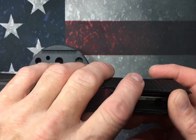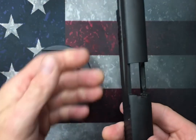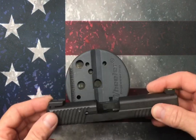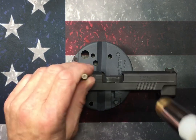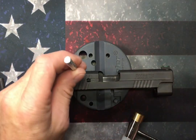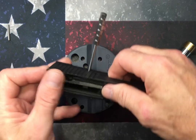Basically the only thing we need to do here is drift this pin out. There is a safety lock here which needs to be pushed in while we're removing our firing pin, which is located right here. Just like your sights, this roll pin goes from right to left — the same way you take your sights off on the Sig pistols. I'm going to line up a hole in my armorer's block and use my hammer and punch to punch that pin straight through.